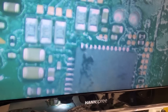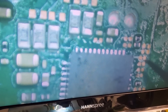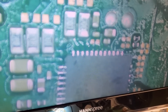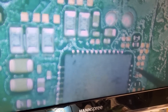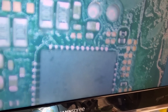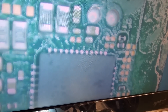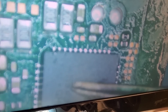Very good — flux is your friend. Very nice, very nice. Let it cool down. Now you want to press in the center and apply hot air again. We want to make sure those pads under the chip are making a connection with the pads on the board.